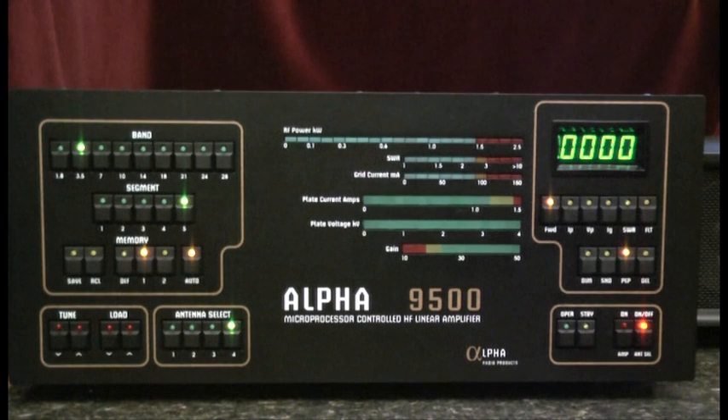Finally, we need to consider the antenna and antenna components. Make sure that the antennas you intend to use with the amplifier are capable of handling 1500 watts at a minimum, and that the duty cycle of those components is also in accordance with your intended use.